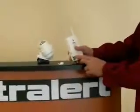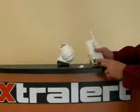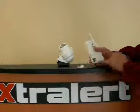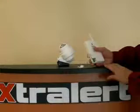Dry contact closure. Dry means there's basically no voltage, it just makes a connection. You can go up to a 2 amp connection with it, so you could wire 110 directly into this, low voltage, intercoms, phone dialers, X10 devices. So there's a lot of options here as far as hooking up other peripherals to the basic system.